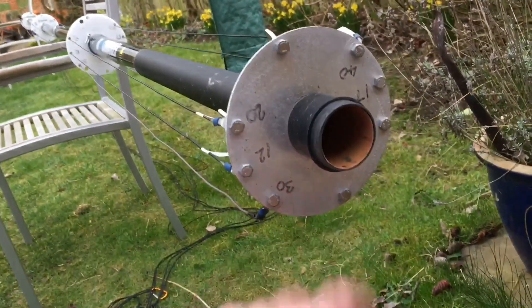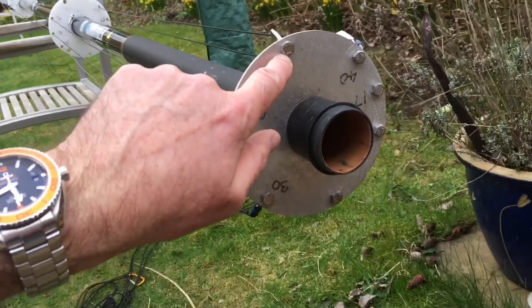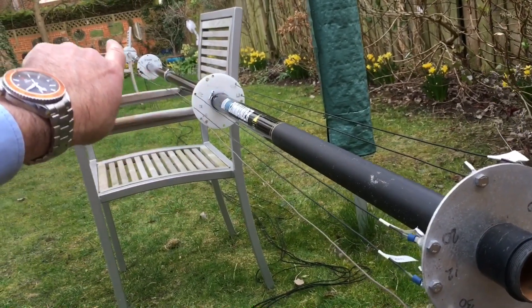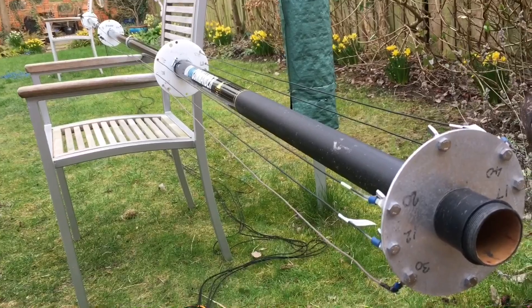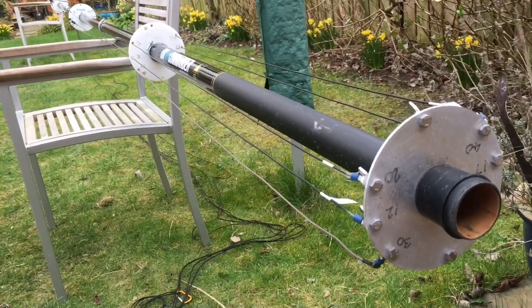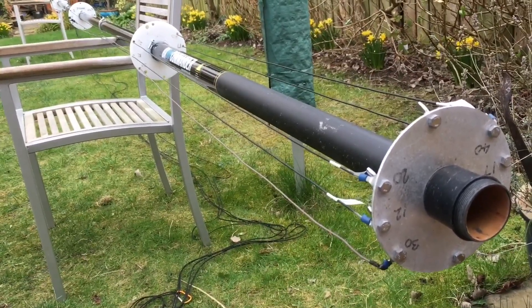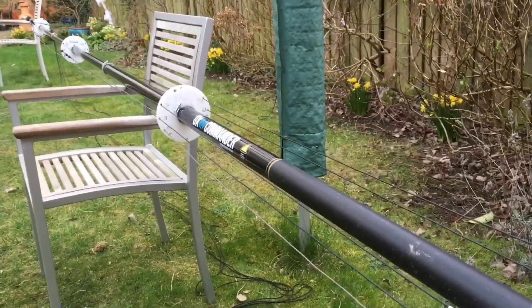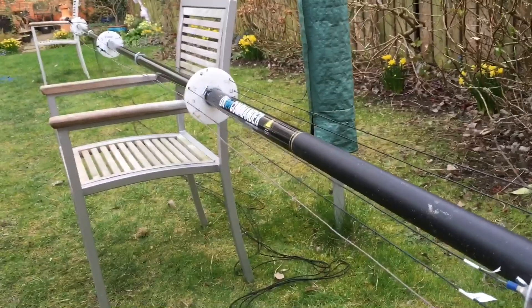There are two unused nuts - one is for the feed off the coax and the other is spare. In my first experiment I used the spare nut and some spare spreader spaces in the spreaders all the way down to add an 80 meter element to run in parallel with the existing 30 meter element. In Callum's original instructions - Callum being the designer and builder of the DX Commander - he recommends you exchange 30 for 80.